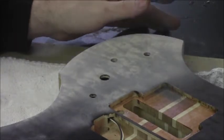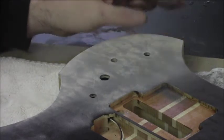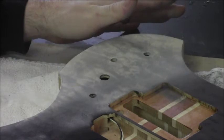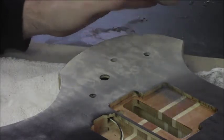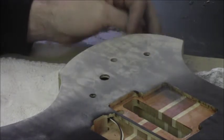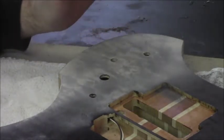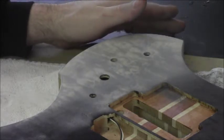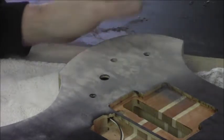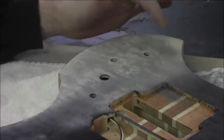It's a fine line between having too much dark and not having enough, so you really have to do a few strokes, clean it up a bit, and have a look to see where you're at with progress. Another thing you can do is take a little bit of naphtha and wipe it down — but I'd recommend getting most of the stain off first before doing that, because it can reactivate the stain and pull it into the lighter areas. Make sure you don't saturate the cloth — just enough to moisten it so it evaporates fast and doesn't smear the stain where you don't want it.